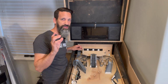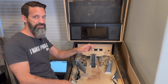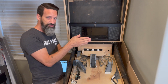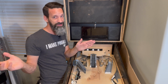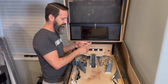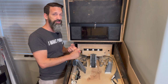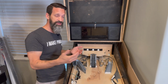Well, in the default MPF support for stepper motor, it's going to an absolute position of 50. Remember, I've got negative 200 to positive 200 as my range on my stepper motor by default. So if I start at 0, I've only got positive 200. MPF will not allow negative values, at least that I'm seeing. It's giving me errors. And so if I want to move forward 50, great, I can hit that. If I want to move forward another 50, I need to basically tell it to go to 100, right? 50 plus 50. And then I want to go to 150, then to 200.